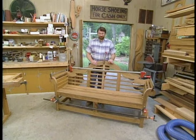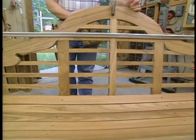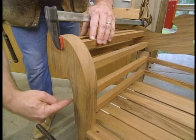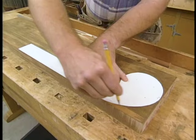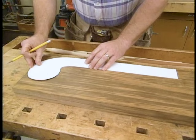I hope you have a band saw and a good way to make mortise and tenon joints, because that's what this project is all about. If you'd like to build one of these benches, a measured drawing is available with a materials list. Now I want to get started today making the front legs. They come up straight and at the top there's a little loop that comes around. I'm going to cut those out of this blank of teak that's about three feet long and nine inches wide. I've made a poster board pattern of the decorative part at the top and I'm going to trace out one of the legs on this end of the blank and the other one on this end. Then I'll rough it out on the band saw.